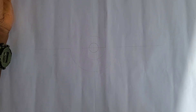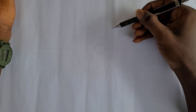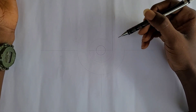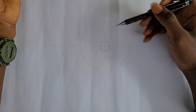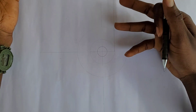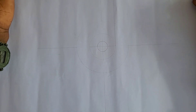From the question we have an offset roller of 18 millimeters in diameter. I'm going to be drawing that offset roller to show that the distance between the center of the offset roller and the center of the cam is 50 millimeters. I'm also going to be drawing a circle 86 millimeters in diameter to show the maximum lift the cam follower has, and I'm going to be projecting lines from my 50 millimeter circle and my 86 millimeter circle to draw my displacement graph.